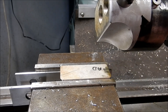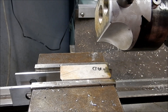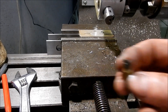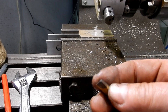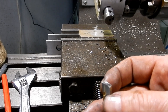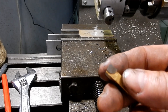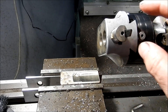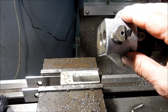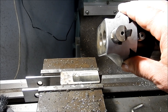That's chalk and cheese - that's beautiful. We'll finish that through and bring you back when we're getting towards the last of the cuts - it's working out nicely. Well, we totally destroyed that carbide bit too. I've ground up another one and put a bit more of a radius on the tip. I'm about halfway down the cut again and this tip is getting destroyed - I only get about halfway down then I've got to regrind it. I've tried changing the feed rate and the speeds but nothing's really helping, so we're going to look at another method to cut this radius.